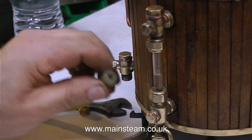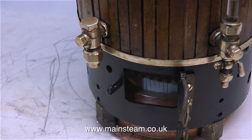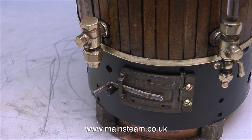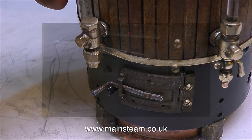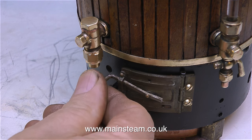I've just half-filled the boiler with water, so now it's time to light the burner in the firebox. What you can't see at the moment is me sniffing the funnel — not that I hang around sniffing boiler funnels, but I'm looking for the horrible smell that comes from a lot of gas burners. And no, it's as fresh as a daisy. Sometimes burners are okay in free air, but when you put them in the firebox part of the boiler they'll start to emit fumes. One day all gas fireboxes will look this way — that's a really hot flame, and there's no great roar; it's running very quietly.